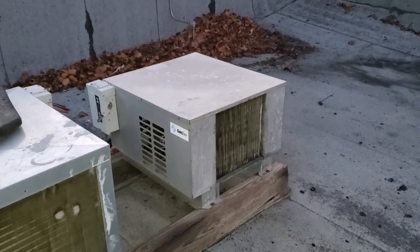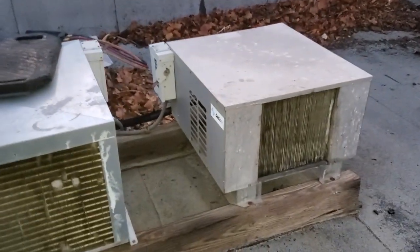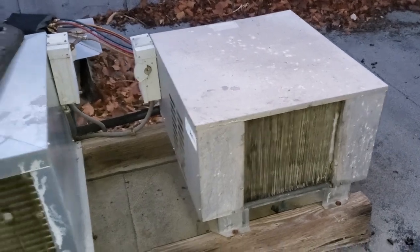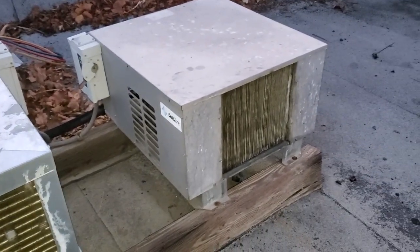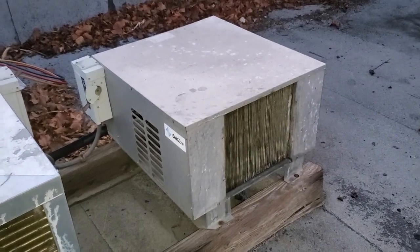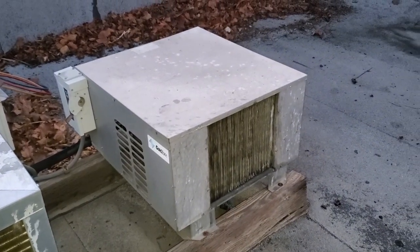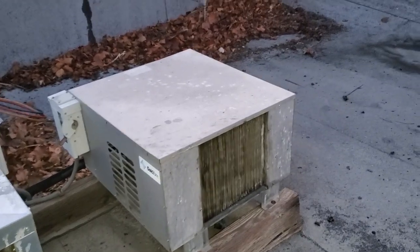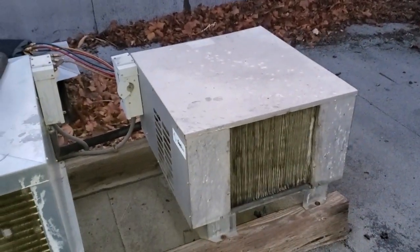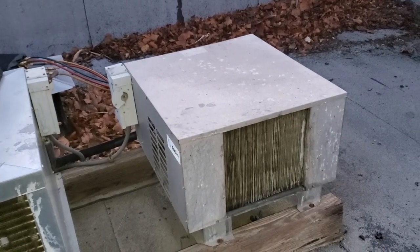We got approvals and we are here. It's an early morning. We're going to be doing a crane lift, placing this condensing unit and putting a new evaporator. What I'm going to do to make things go smooth — so I don't have to bring my recovery machine on the roof — is we're going to do a pump down, front seat the receiver, tuck my gauges in the cover, screw it back down, lift it off, and do the recovery on the ground.